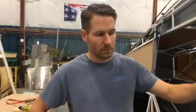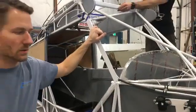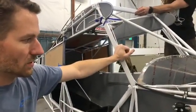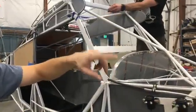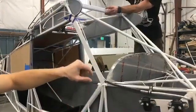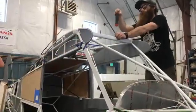So to the windows, the wide body from Airframes is 4 inches wider, so a stock Super Cub windshield won't fit. So it requires a PA-12 windshield, which is sitting in a box waiting to get cut and fit, and that's pending some more pieces for the boot cowl before we can put the boot cowl on, and then we'll have to custom fit that PA-12 windshield.